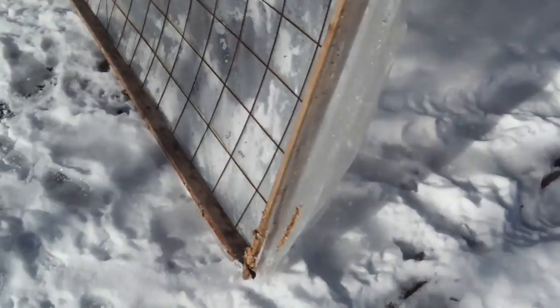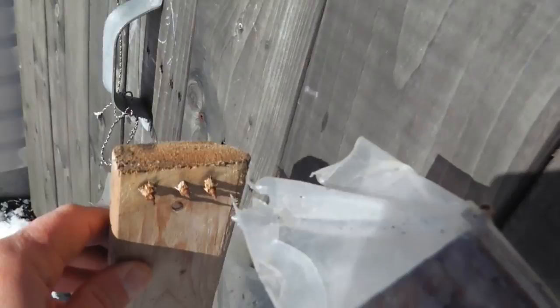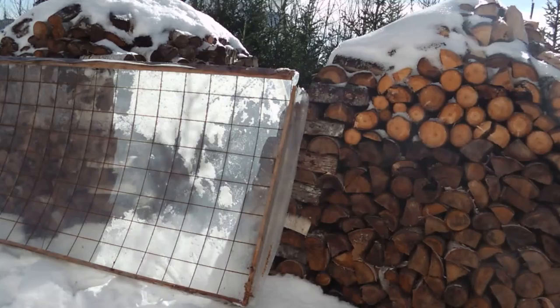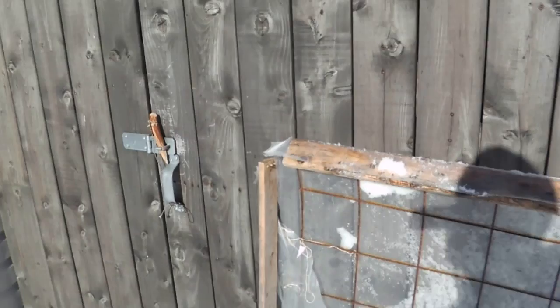Just showing here how it was broken. I nailed the end pieces onto the butt ends of the long pieces, but there just wasn't enough purchase there — not beefy enough to hold it in any real way. So I decided to attach these heavier logs using longer screws and in a different way, which will give the thing more weight so it's less likely to blow away, and also a lot more purchase.